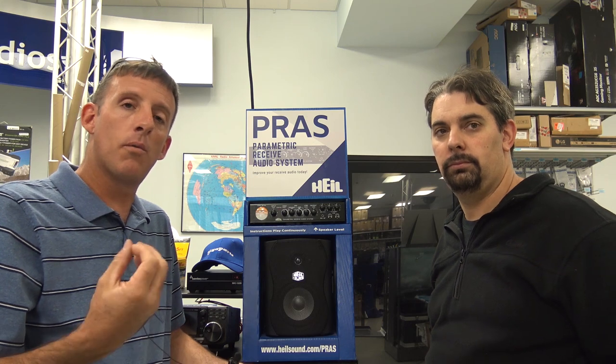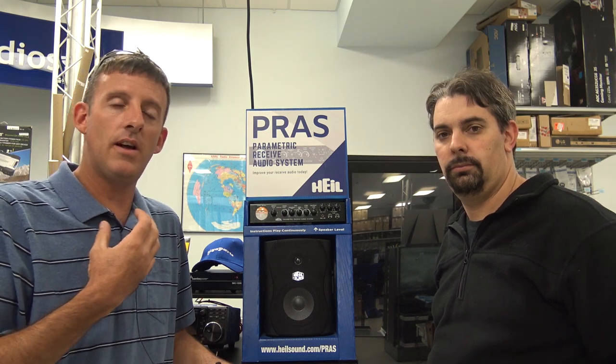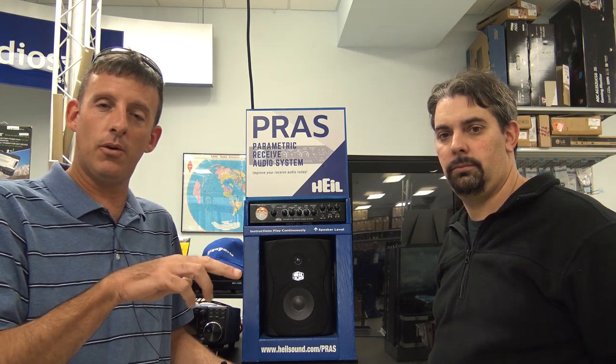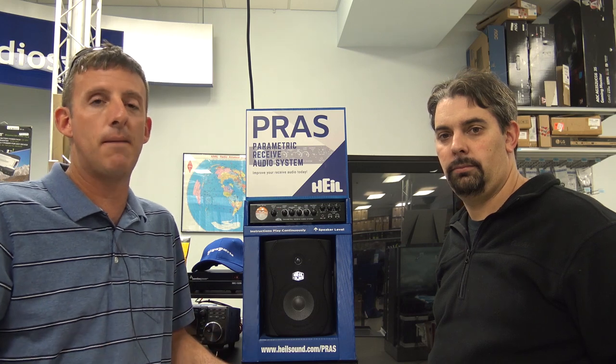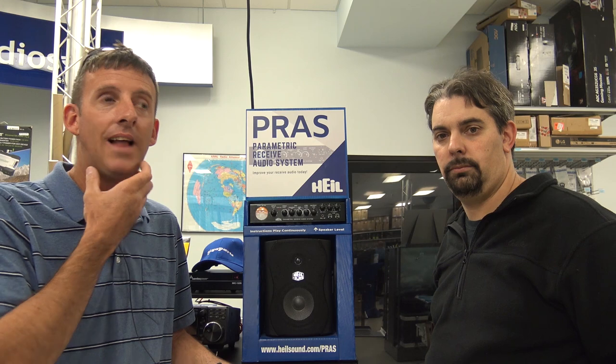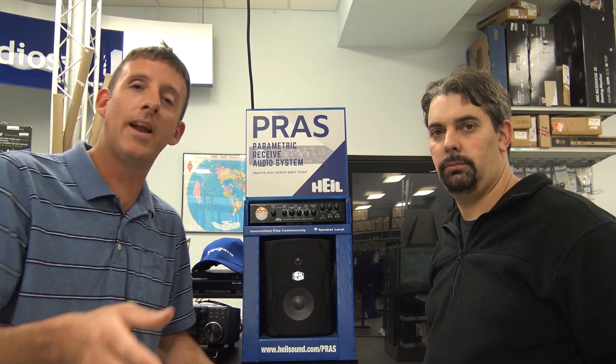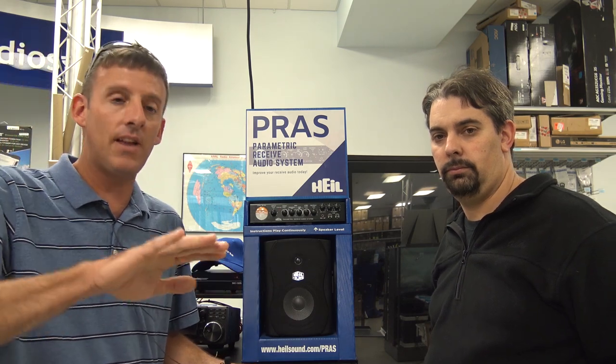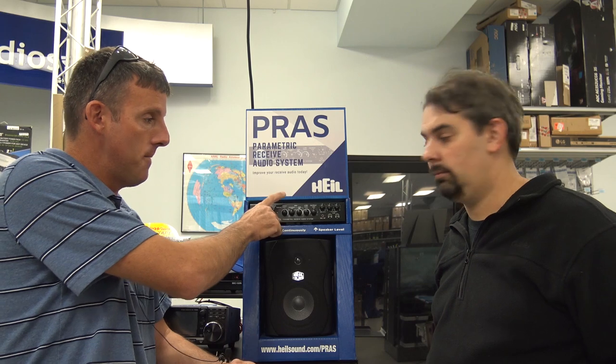So I can make that other station sound bassy, I can make that other station have more mids. Some people, when they're on the radio — especially on digital, which this isn't really made for digital like DMR or anything — their voice frequency by nature happens to be deep or high and it conflicts. They can't help it, that's just the way they talk. The same thing sometimes happens on sideband. They have a very bassy voice, a very loud audio voice and they don't mean that to happen, and sometimes it makes it hard to hear. Instead of saying, hey buddy, turn your lows down or turn your highs up, you can actually adjust what you're hearing. It's not changing anything on his end, but it's changing what's coming in on your receive.